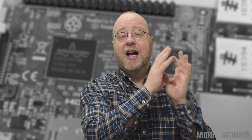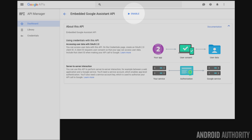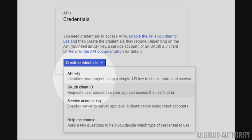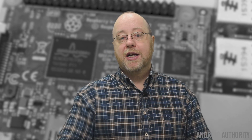The reason you need your Raspberry Pi connected to the internet is because a lot of the heavy lifting is done using Google's cloud services. To get the Google Assistant working, you need to connect to and configure a cloud services account at Google. Basically, you log in, create a new project, enable the Google Assistant API for that project, create OAuth credentials so that your Raspberry Pi is authorized to access your account, download the JSON file containing those credentials, and put it on your Raspberry Pi renaming it to assistant.json. Once that's done, it should work with Google's cloud services.